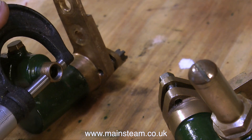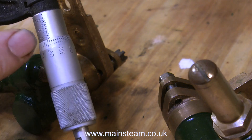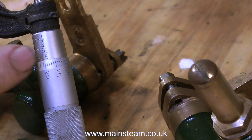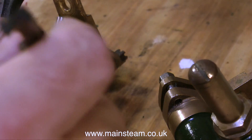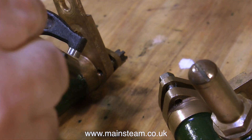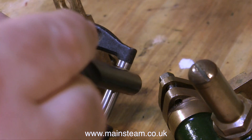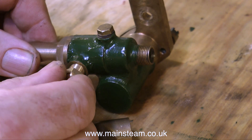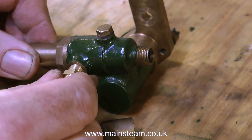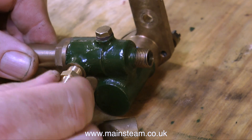I've already tested these out with water, and they work very well — they pump very well indeed. I need to know what the threads are, so the first port of call is a micrometer, and this one is 7/16ths of an inch in diameter. As long as a 7/16ths of an inch drill fits nicely through the gap, then it's a 7/16ths of an inch diameter thread — it just saves time. I'm now trying to work out what the other thread is. It's 3/8ths of an inch, but is it 26 threads per inch, 32 threads per inch, 40 threads per inch, or 28 threads per inch BSP?